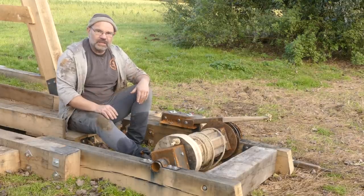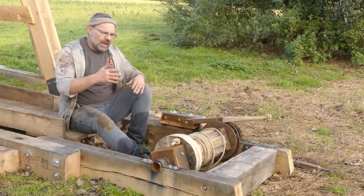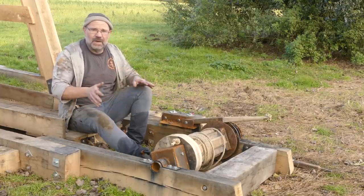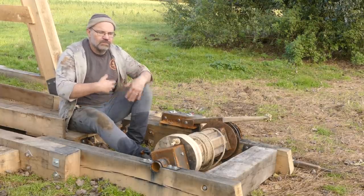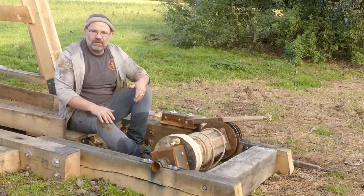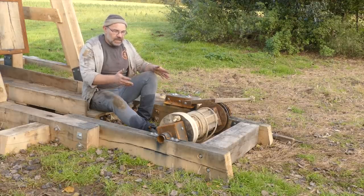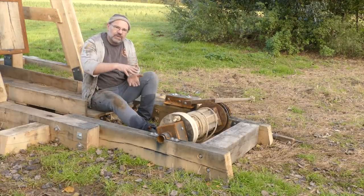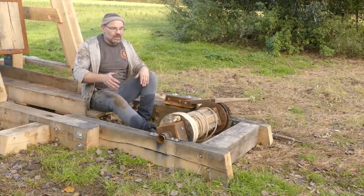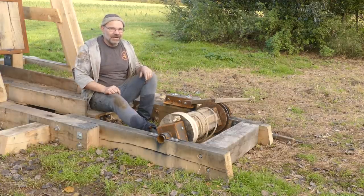It's got quite a big winding drum — probably a little too big, because it is quite difficult to wind. However, I had to consider reload time on the filming, because everything's about the film. You've got to reload quickly, time is money — a bigger winding drum means quicker reloading even if it's harder work. Now I'm going to reduce the drum diameter, which will give the winch more power and make it easier to load but slower. That means I can put a bigger weight in the counterweight, and that's definitely what we all want.